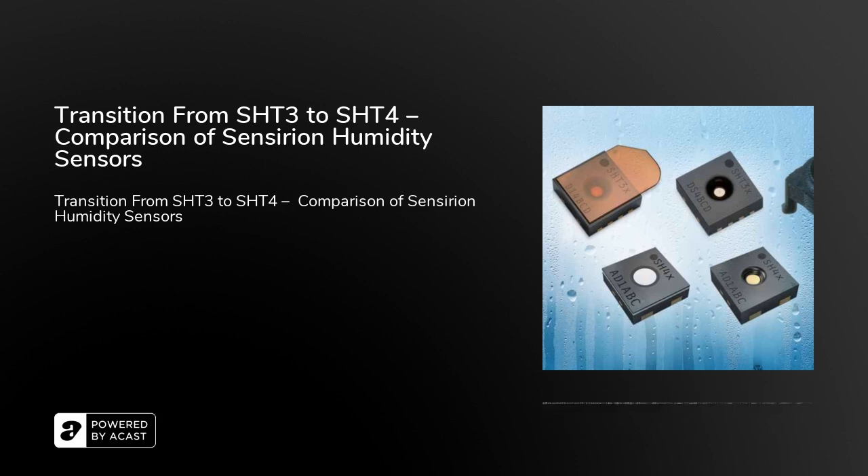The heater in SHT4X sensors can be used in two cases: 1. Removal of condensed or sprayed water on the surface of the sensor — although condensed water is not a reliability problem, it will cause the sensor to become unresponsive to changes in relative humidity if there is liquid water on the surface. 2. Long-term exposure to relative humidity levels greater than 90% RH may induce a reversible positive RH shift called creep. Periodic heating enables measurement in high-humidity environments for a long time without the creep effect.